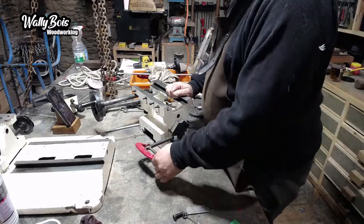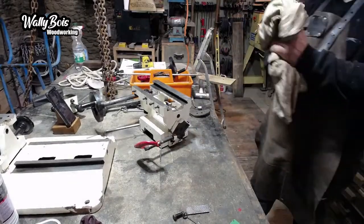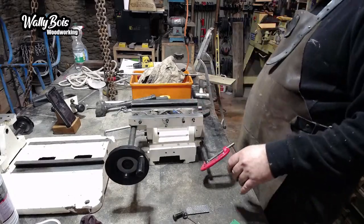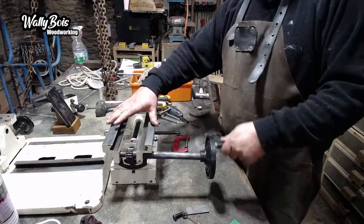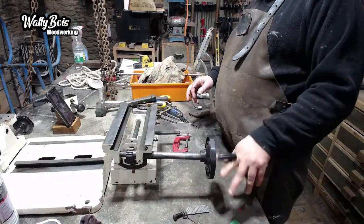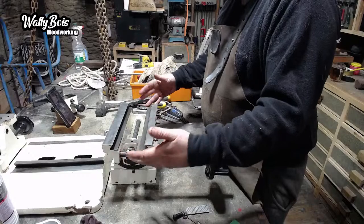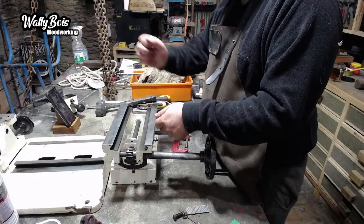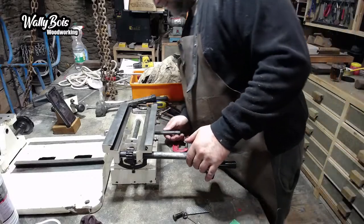So ideally, I need to make one there, whether it be wood or metal, I don't know, whatever I choose to use. It needs another handle, sort of like a little wheel. It's not how often that one gets used, to be fair. It's that way around. That's it, like that. So this one will move the carriage to and fro, so you can do longer mortises. Now, some of the cheaper or smaller machines don't have this carriage arrangement. You actually physically have to unclamp your bit of wood and move it along and then do the next square hole, move it along to the next square hole, which is all very well, but this machine's more pucker. It's a good machine, it really is.